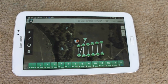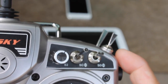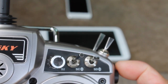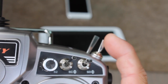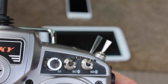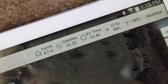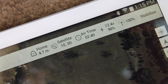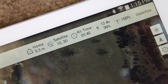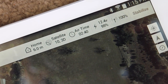In between we're flying these waypoints at 60 meters. I always fly with my Taranis even though we're in auto mode — I always want to make sure I'm able to take over. This is stabilized mode. I'm going to switch into auto, and you can hear that Droid Planner echoes back the mode we're in. We have good satellite coverage and 99% battery, which is obviously crucial. Today I'm flying with a 3S which should be sufficient for this mission.